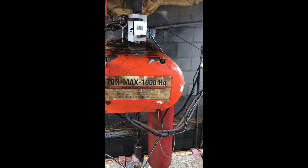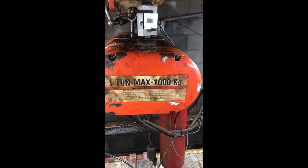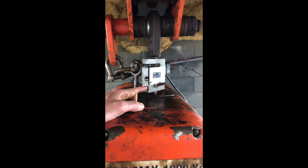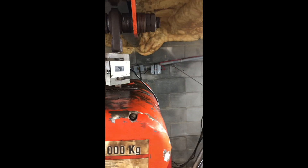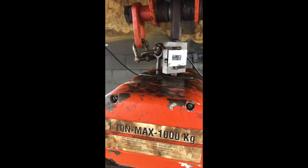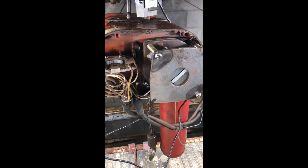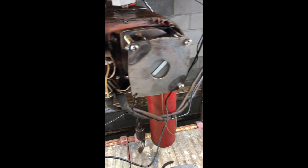First step, we're going to take the back cover off with four flat head screws. Once you take those screws out and pull this whole cover off, the brake mechanism is right behind here. This is the load cell — it actually measures the weight. You can see the cable that goes down to our digital readout; this is actually the second one we've had to replace on here. Just a couple little issues here and there, but we always have to make sure we're getting accurate weights. I got the cover off and these are pieces of the brake that were falling out as I took it off — this thing is definitely well worn. Should just be these two flat head screws on either side there.